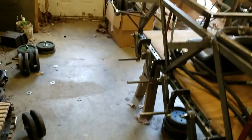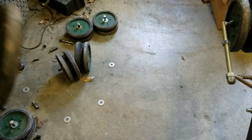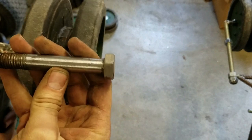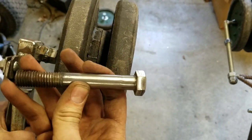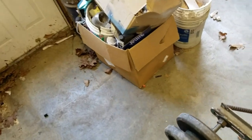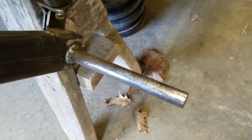Next are the modified suspension arms. The old suspension arms just had two nuts welded on with a five-eighths inch bolt that held the wheel on. The problem was that during the first test drive, one of those bolts bent, which meant more would bend later on. I didn't like that setup from the beginning anyway. So I ground off the bolts and welded on a piece of three-quarter inch round stock, six and a half inches long, on every one of them. That'll be much stronger.